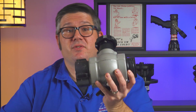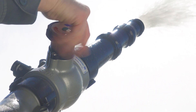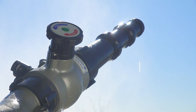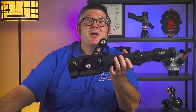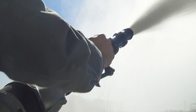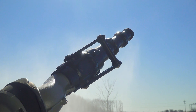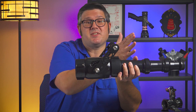This common slow close hydrant valve, for instance, has a full two and a half inch diameter waterway that's completely unobstructed. Now this valve is also common in this application but has a two inch waterway, which is still okay to use and will work perfectly fine, but it's just something to consider when you're trying to pair your monitor, the valve, and the set of stacked tips.